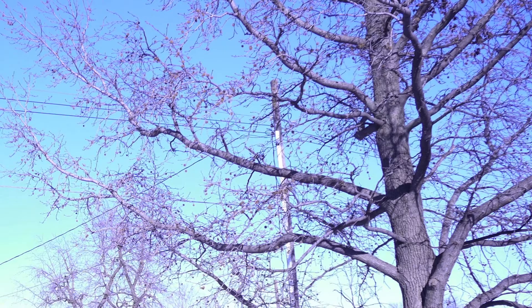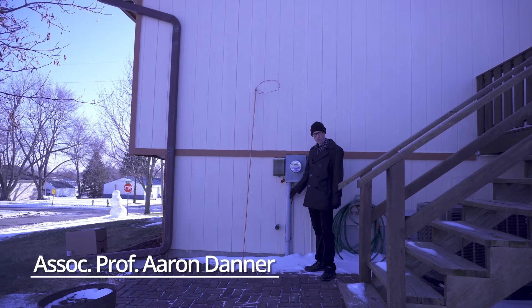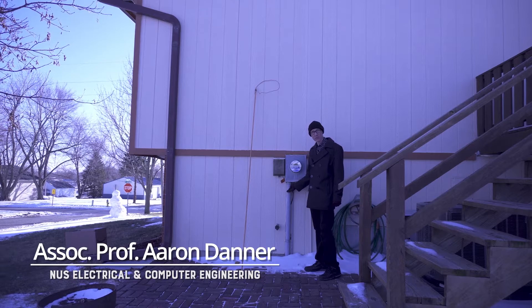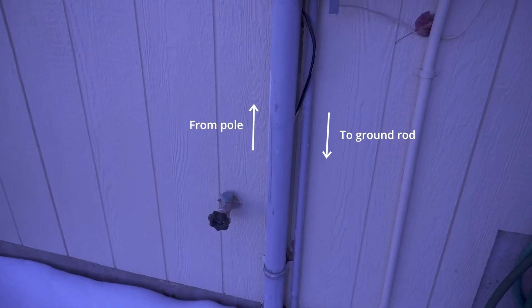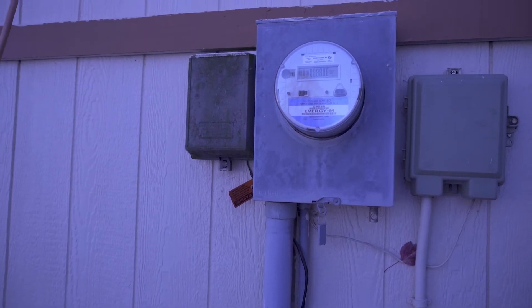One of those branches goes down the pole underground and up through the conduit here under the electricity meter. The three cables from the pole come up through this piece of conduit and into the electricity meter.